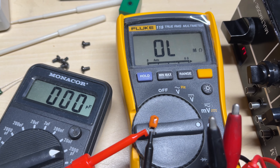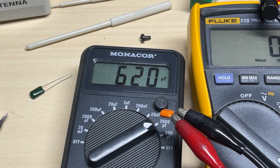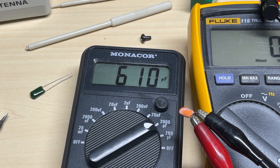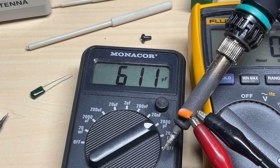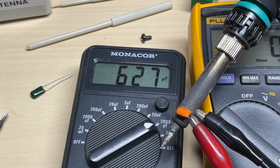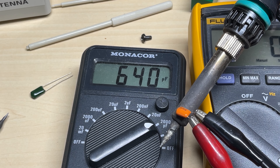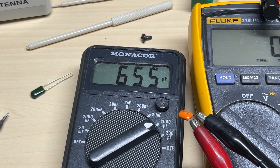So I'm trying the resistance reading — we're not getting any resistance across the capacitor, and now the capacitor has settled down again. So I'll try to freeze it and heat it to see if I can make it go silly. This might be the issue: it'll work fine for ages and then something will happen and it'll go into one of its little episodes where it decides to go all over the place, and then maybe it'll just right itself.